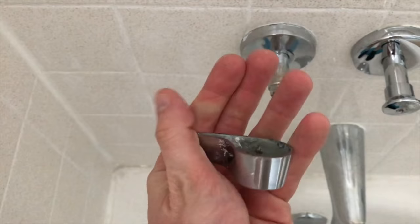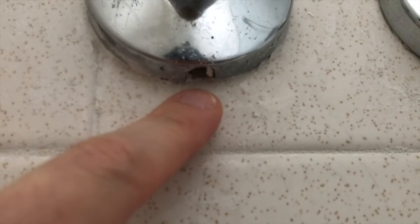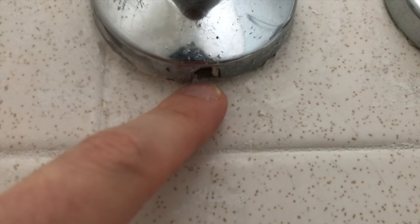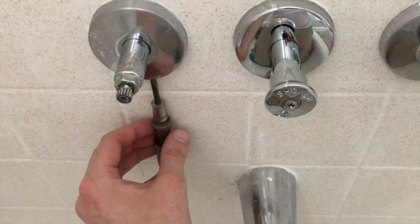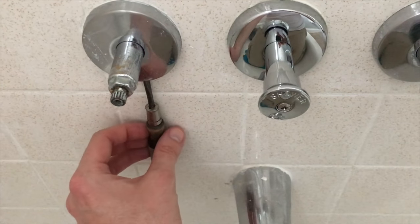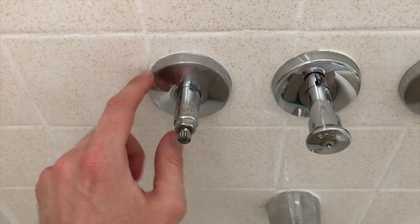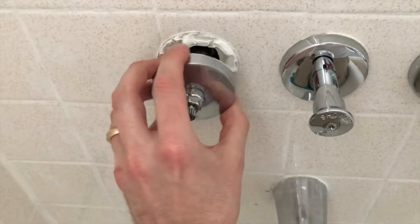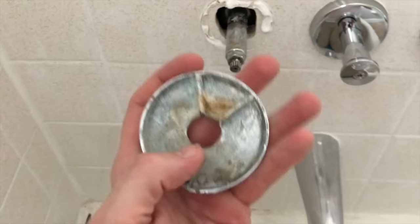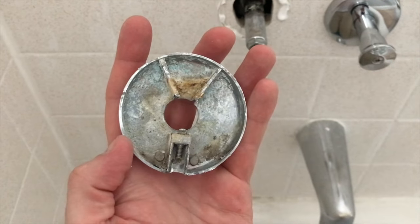Set the handle in a safe location. On the bottom side you have an access hole — grab your flat-head screwdriver and remove that flat-head screw. It will allow you to pull the cover plate off. It is a very tiny flat-head screw, and once you get it loose, depending on how much plumber's putty was added, that will determine how hard it is to get the cover plate off.